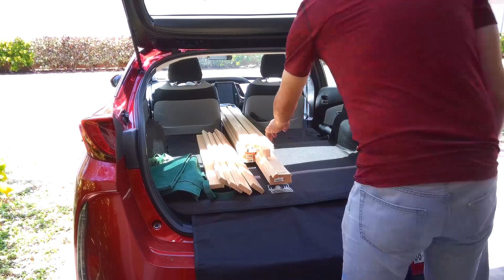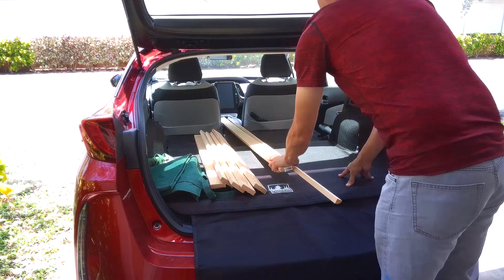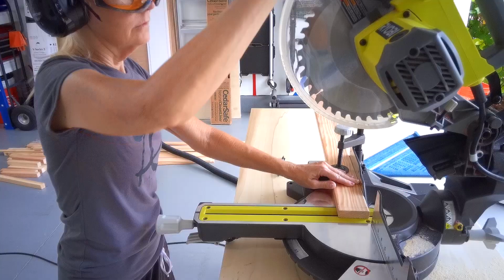We thought about using 3/4 inch plywood for shelves, but since it's a linen closet, we thought slatted shelves could provide a little airflow, and went with a 1x3 Douglas fir for the shelves and 2x2s for the cleats, which we anchored to the walls. Mr. Poor Man cut the cleats and I took care of the shelving slats.